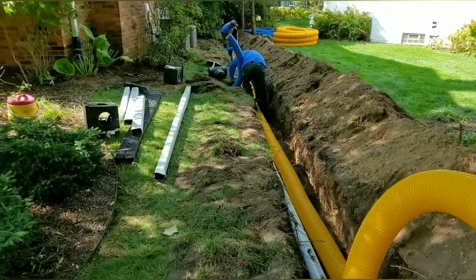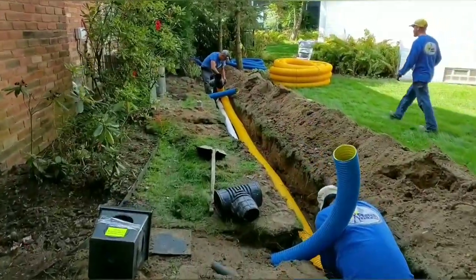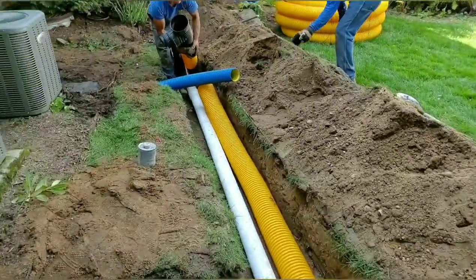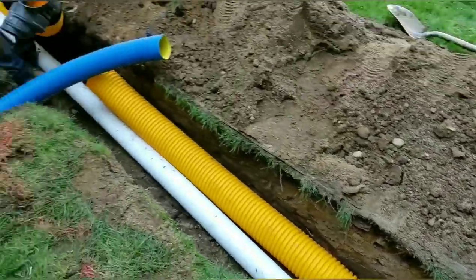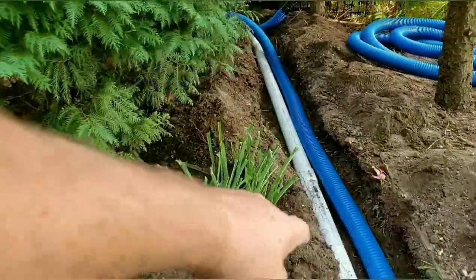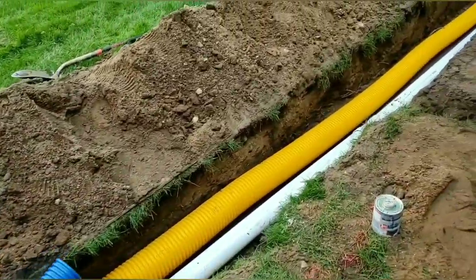We'll haul out a little bit of sand, and we didn't have to haul in any stone because this is not a French drain. This is a roof runoff system. And we actually got 3 sump pumps tied into this sump line. So there's a sump line right here. That was all done Mickey Mouse, and you know, we took care of that. Did a real nice job removing that old system that was failing miserably. We got 2 sumps coming out of the backyard. So that 4-inch pipe is going to be moving some water during hard rain events.